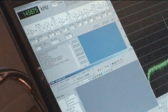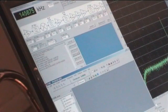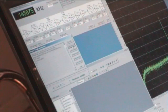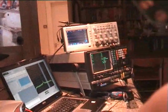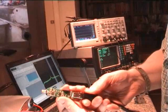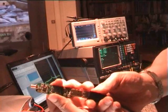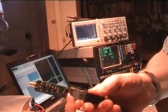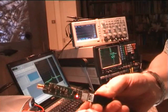The next thing I want to do is move the camera around. You'll see there's a bootloader — it's been recognised. All I have to do now is say I want to write the firmware. It takes a few seconds — you'll see it whizzing down the screen. That's it. Then I take the unit out of USB and plug it back in again. You'll see a little LED has suddenly appeared here. We're now in the real SDR software.